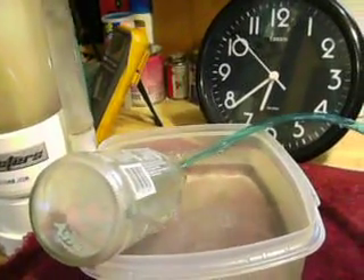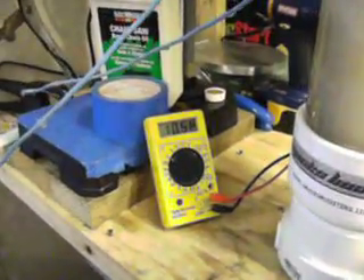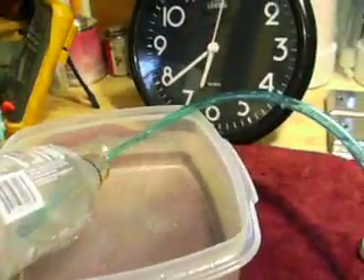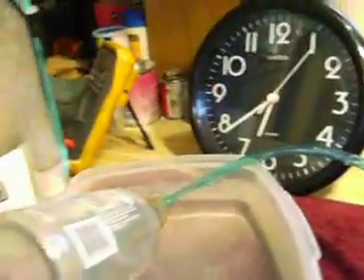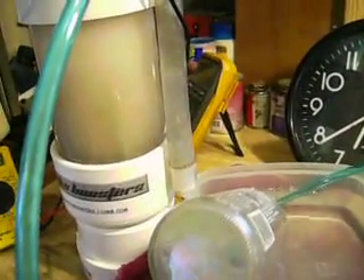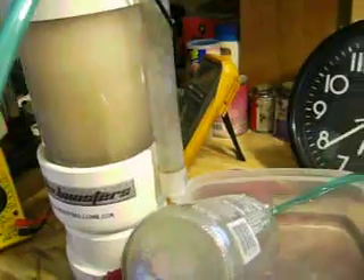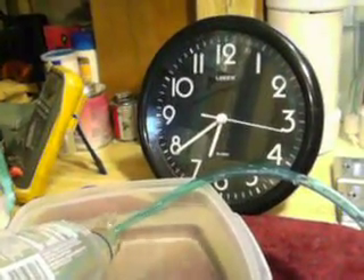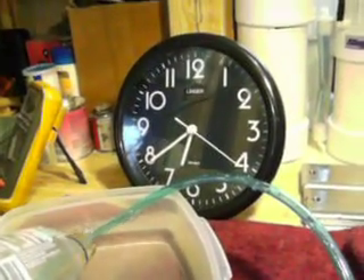This one is just slightly under my normal 1.2 liter per minute mark. As you can see, my battery is getting tired — we're already down to 10.5 volts, so that's a pretty good number for a tired battery. As you condition your plates and they approach optimal efficiency, when they get the catalytic layers built upon them, you will approach the claimed 1.7 liters per minute benchmark for a fully conditioned cell.